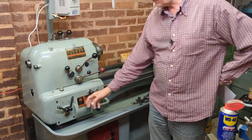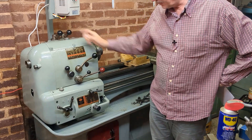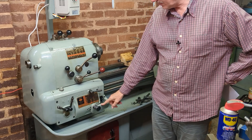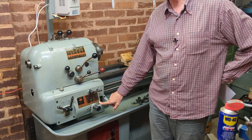I took the cover off actually because I thought it was a gasket — it wasn't. That also gave me an opportunity to adjust the gating mechanism for the gear change. This last position just wasn't quite engaging and needed a slight adjustment.